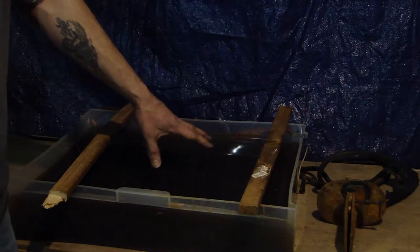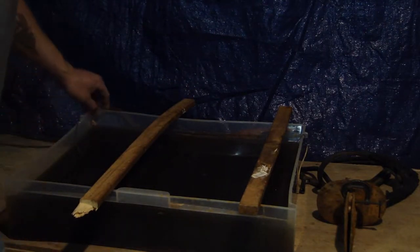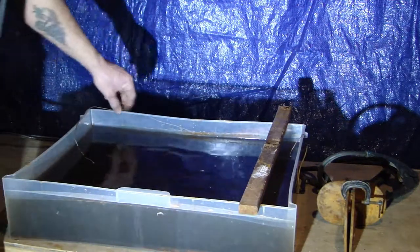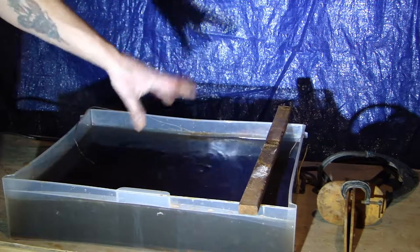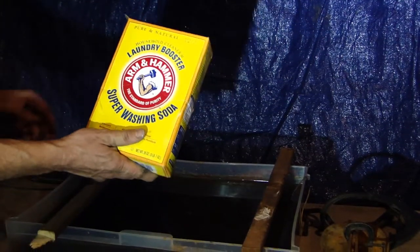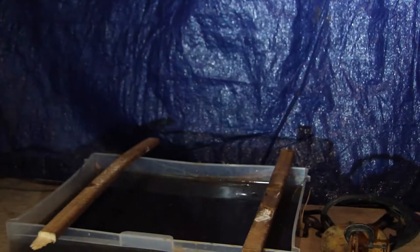I use distilled water — I just stick a bucket outside when it's raining and get rainwater, so you're not spending a couple dollars on a gallon of distilled water. You want to have your positive lead coming down. You can't see it because I've used this before — I've got an old saw blade in there, an old bandsaw blade, with a couple chunks of iron hanging off of it. This goes all the way around to the other side so you've got a good connection. Everything that I'm cleaning goes in the center. I freshen up the water and it's important to add some laundry booster — Borax is basically what it is. I just add a little bit because I've added a lot of water to it.